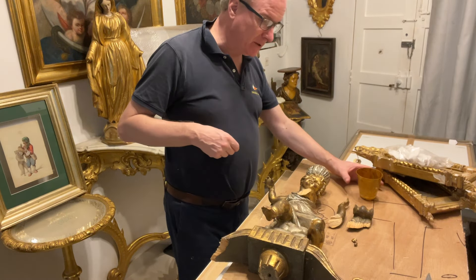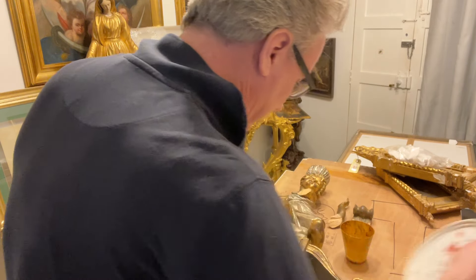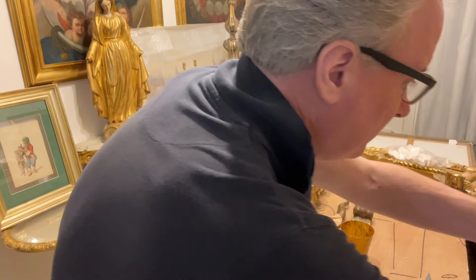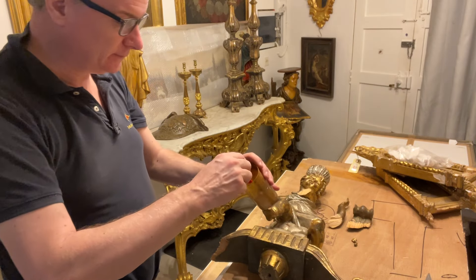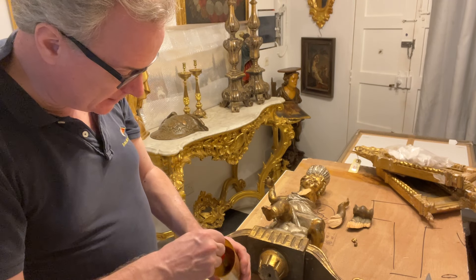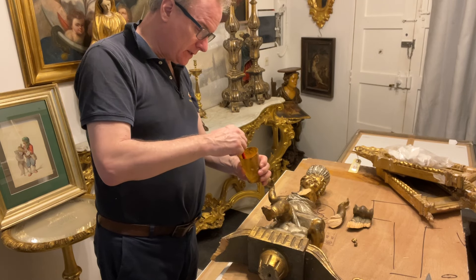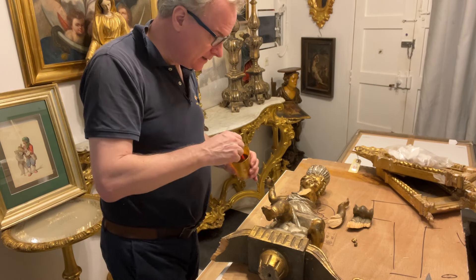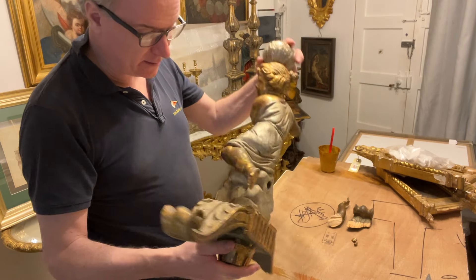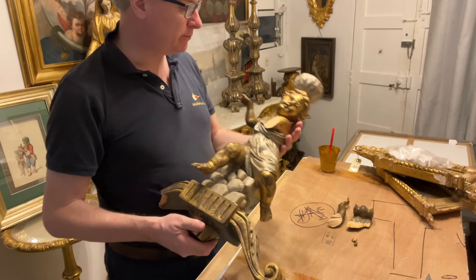I put a scoop in a cup, added some water, microwaved it for 30 seconds, and let it sit. Now I'm going to stir this hide glue — it's very hot and nearly totally dissolved. I'm going to stick together this cherub which got broken in transit from England. The cherub is a fitting from a wardrobe or piece of furniture, basically a rococo-style piece of wood, probably from the 1920s.